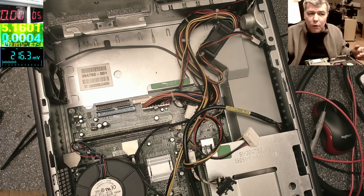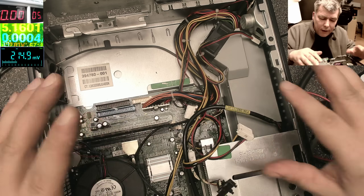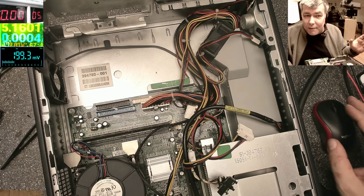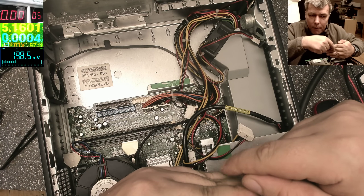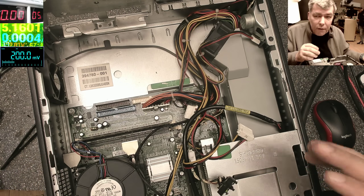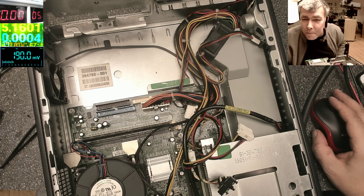So that's how you can check if you have dry capacitors — you connect a capacitor on whichever line you want. In my case it's the 5 volt standby line, but you can do it on 12 volts or 5 volts as well. I'll open the power supply and replace the capacitor I missed — it was a fat capacitor on the board with the small transformer, and I said on the previous video I forgot to replace that one. That's how you identify this problem even when the tester and multimeter both say the power supply is good. Thank you for watching, like and subscribe if you liked the video, see you on the next one.